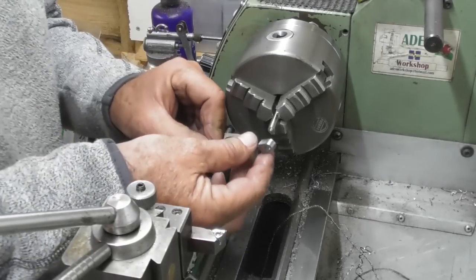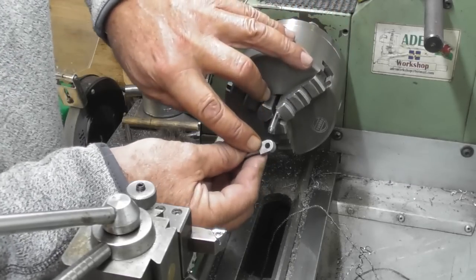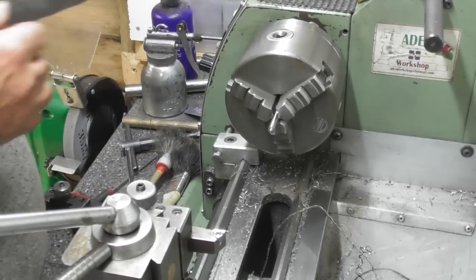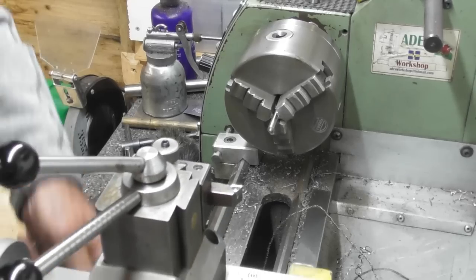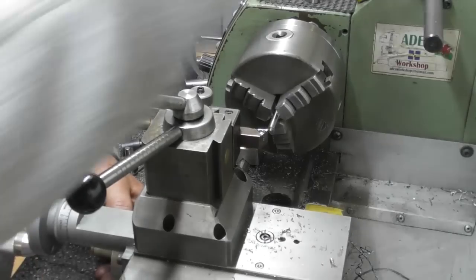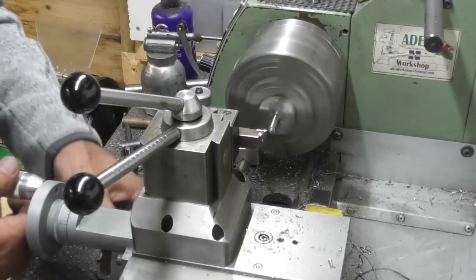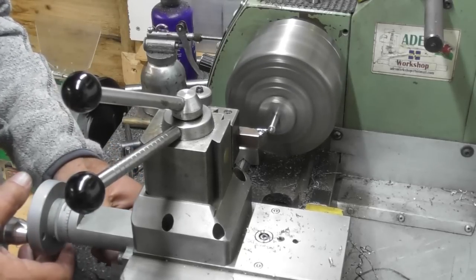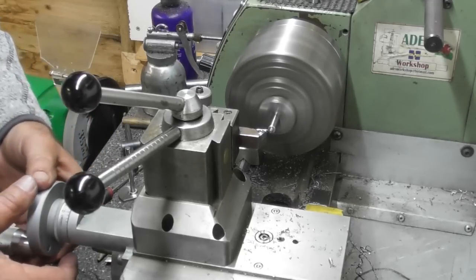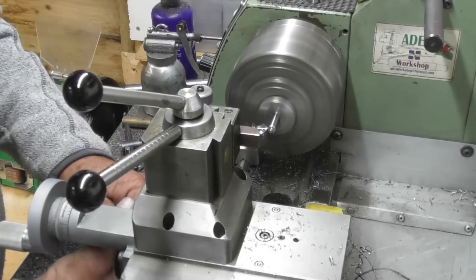So as you can see, the quarter does actually fit in that counterbore, but I need a shoulder, the diameter of that bore, which is 3/16, 187 thou back. And with a DRO, it should be fairly simple. And of course, 3/16, let me just set a 0 on that shoulder. 3/16 is what we're aiming for. 1875. We're 250 at the moment, so I know I can take 25 thou aside easily. So I'm going to turn back to 180.